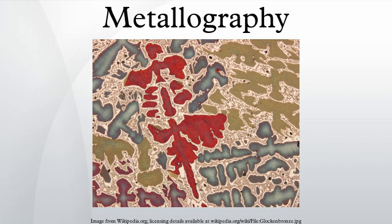Preparing Metallographic Specimens: The surface of a metallographic specimen is prepared by various methods of grinding, polishing, and etching. After preparation, it is often analyzed using optical or electron microscopy. Using only metallographic techniques, a skilled technician can identify alloys and predict material properties.